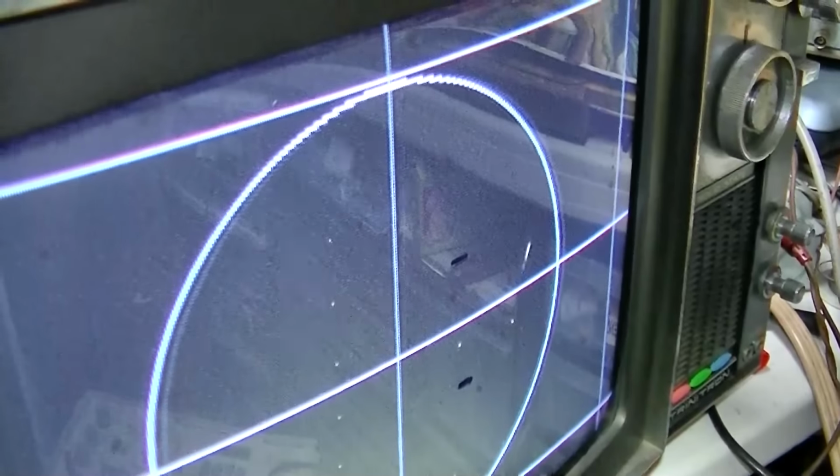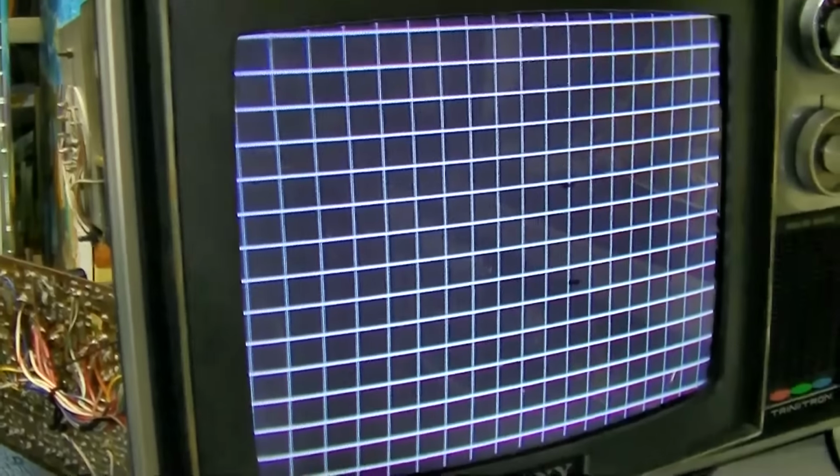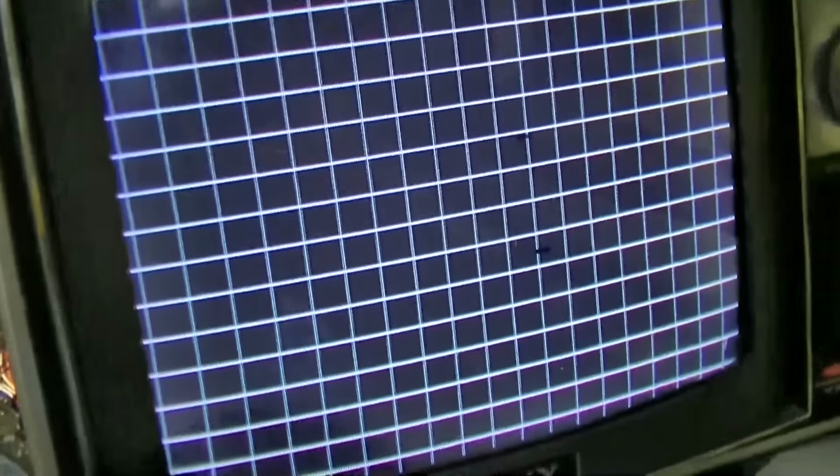I always tend to underscan them. Because if you ever look at the milliamps running through the transistors or the tubes, the more you overscan it, you just drive the living hell out of the current through the tubes. Don't need to overscan it, just deal with it. The horizontal linearity is not great either, is it?